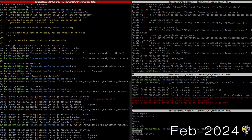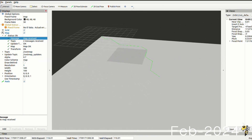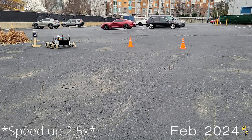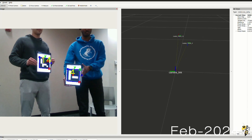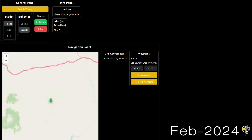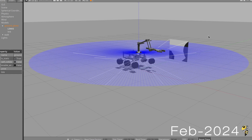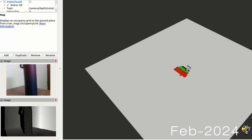Our custom-built navigation algorithms use various nodes in ROS2 to estimate pose using GPS and IMU data fused into an extended Kalman filter, and plan a route to a given waypoint using A*, and navigate through that route. The system replans based on information given by depth cameras onboard, and stops after reaching an ArUco tag or a waypoint, depending on the system configuration. Our web interface allows for seamless monitoring of Wall-E's real-time status and allows users to configure those statuses. We also use Foxglove and RViz to monitor real-time video streaming from the rover, to ensure that autonomous navigation is proceeding as expected over large ranges.